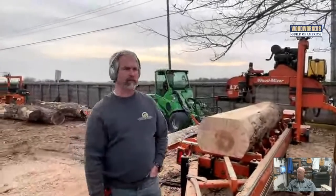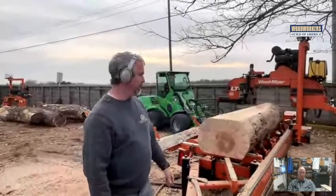Yeah, it becomes much more user-friendly once it's dry and once you're using it in the shop. You'll notice once you get it in the shop after it's dry, whether you air dry or you kiln dry, if that lumber starts to open up or pinch tight, it was cut a little bit out of skew from that heart through the grain in an awkward cutting fashion. But there's a couple of other things that can lead to that tension, not just having it off this heart. That's a huge attribute, shooting for that heart, especially when you go to do quarter sawing.